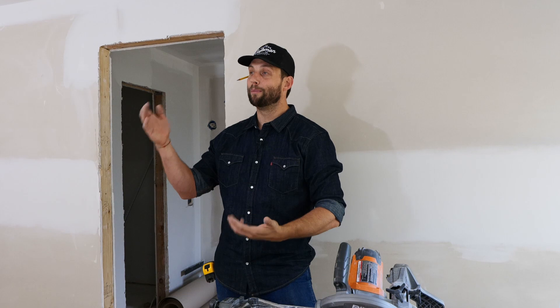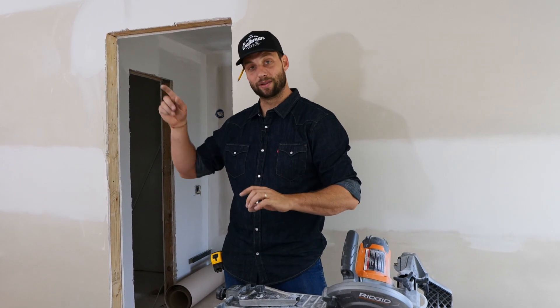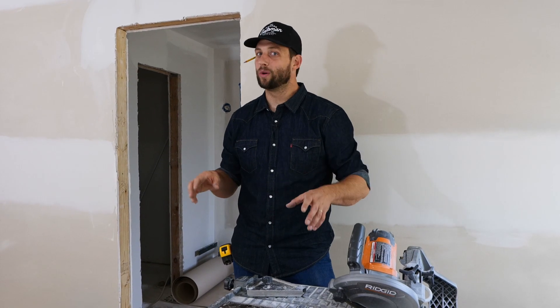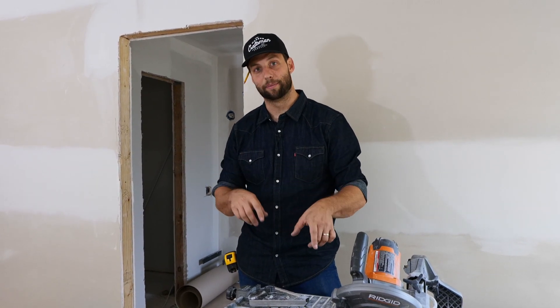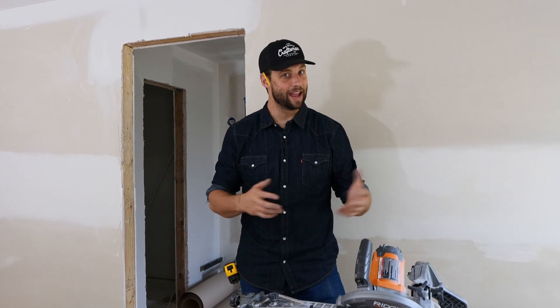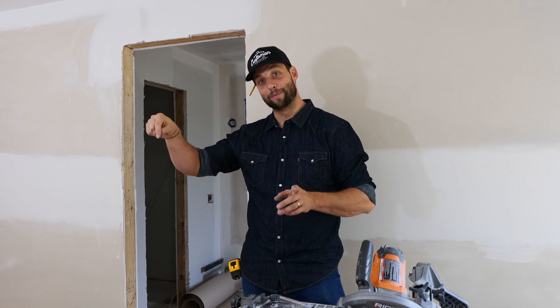For example, I remember the last time I did tile — my wall wasn't very straight because I didn't frame it exactly straight. When I put the backer board on it I had a slight bow, and when I put the tile on there I had a rock of about a quarter inch across it where that one stud sat. So I want to make sure I'm communicating to my framers from the very beginning: make sure those studs are completely straight. Or as the builder I might say, in the bathrooms I'm not going to use dimensional lumber — I'm going to use an LSL, an engineered wood product with completely straight edges, for all my tile backing surfaces, because it makes the tiler's job so much easier. I highly recommend this saw if you're a DIYer, and I highly recommend that any professional builder or tradesperson — carpenter, framer, tile setter, or general contractor — get your hands dirty with the other trades. Start learning what their life looks like, because it will make you better at your job thinking about how to make their work easier as the project moves forward.